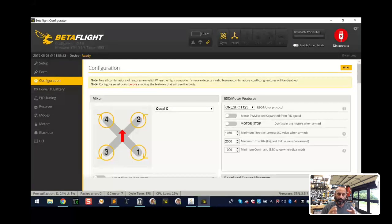Now we're going to go to Configuration - this is where I see the biggest problems with what people are doing. I know DShot is out there, DShot 1200, there are so many options. But going back to the old way - maybe a year and a half to two years ago - we still worked in OneShot and I still use OneShot. I'm 43 years old and these millisecond differences that everybody complains about, I don't notice. But what OneShot does that DShot doesn't is it allows you to calibrate your ESCs and make sure the parameters are close enough that there's no problem. A lot of people forget to do this and end up with quads where a motor dips out or lacks power - you need to calibrate them.